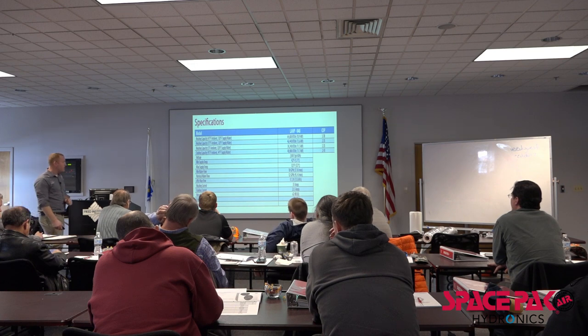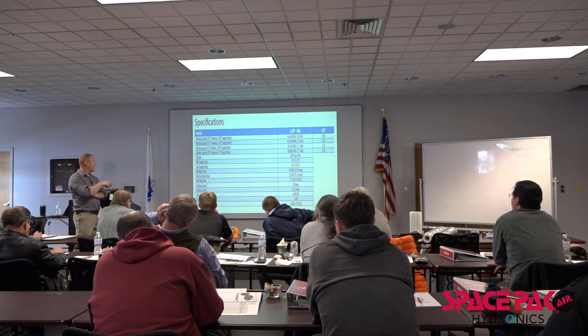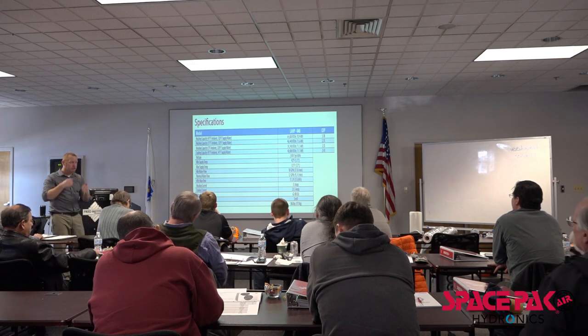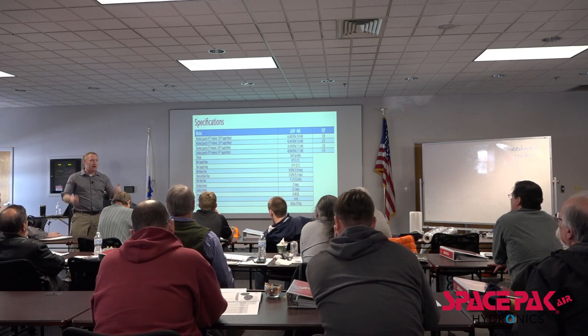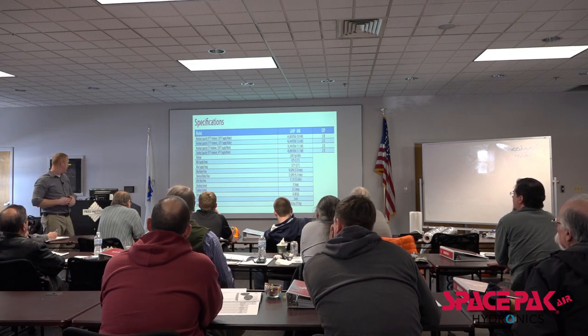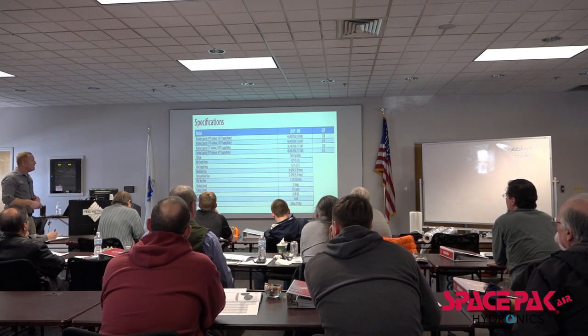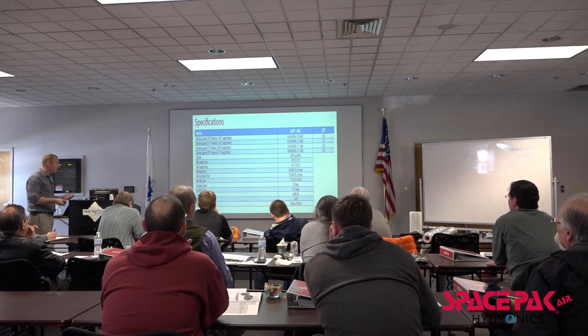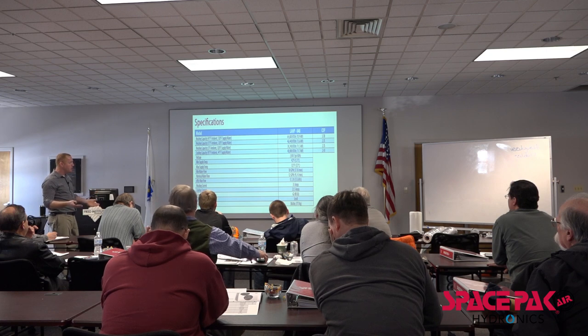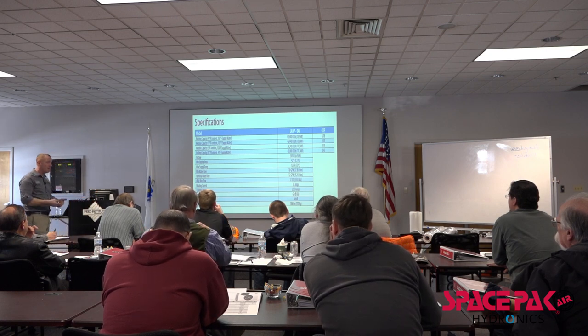Little different breakdown, all right, if we're dealing with our cooling capacity. Remember, we have a little reduced cooling capacity here, but generally if we need more heat, because we're up north, we're not gonna need quite so much cooling load. And for that, again, our COPs are quite high. Again, minimum, maximum 10 to 12 GPM flow through these units, right? We wanna have flow. We're gonna have about a 10 degree water delta.